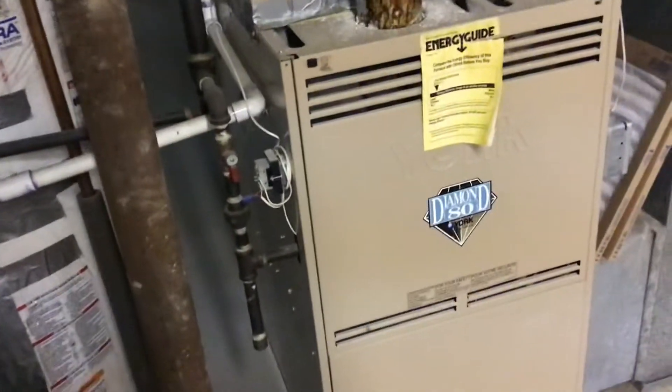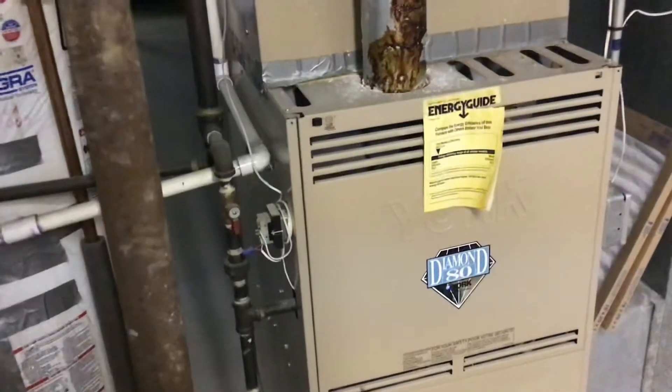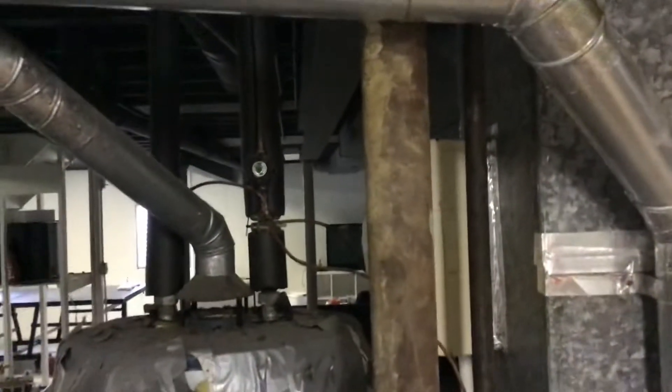16x25 by 1. We're going to want to put a 4-inch box and make the new filter size 20x25 by 1. 10 by 24 on the drop. Probably a 3.5 ton AC. New humidifier.